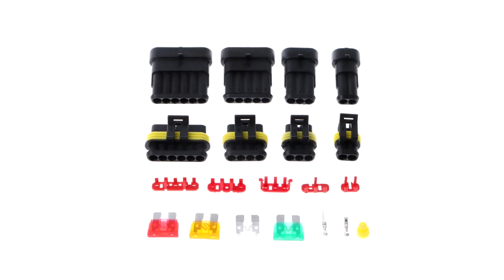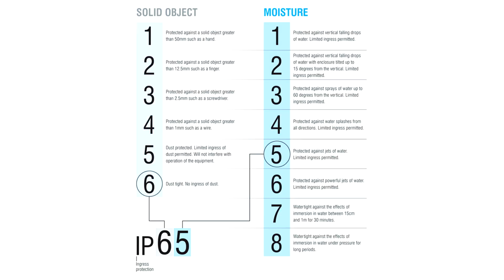And finally, for our last point, is IP protect stuff. IP stands for ingress protection. You've got varied stages of ingress protection. And just alluding back to our joints, what we did earlier, we were talking about joints and stuff like that. If you are going to put a joint on there, I would massively recommend getting an IP rated joint. Whether that be a very basic IP rated or a full-on waterproof IP rating. I'm going to pop the IP ratings up on the screen now so you can gauge what you need.